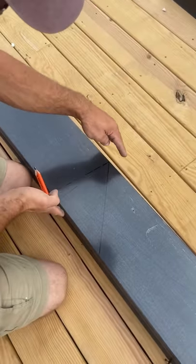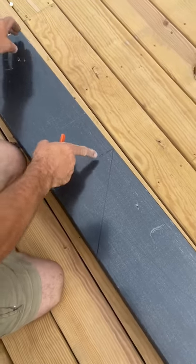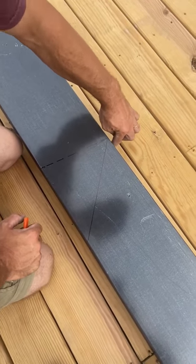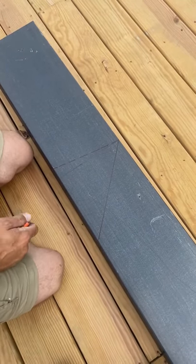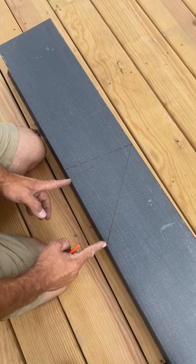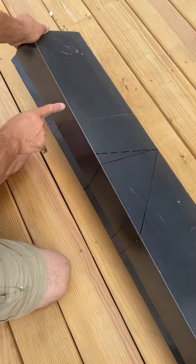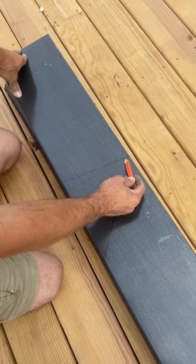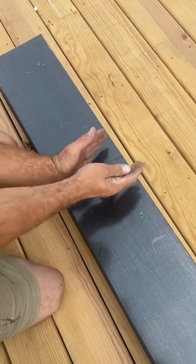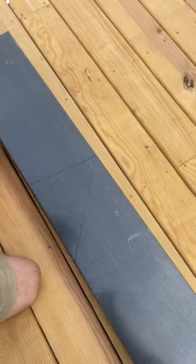The width of our coping is 8 inches. I measured it — I need a size 20 and a half to the outside bend, so that's where I'm going to have my bend outside of the corner. How am I cutting my coping? 45 degrees. So we have 8 inches of the cut, and I have to measure 8 inches on the other side — you'll see why a little later. I trim a little bit off from the 90 this way, because when I bend my coping I want to make sure I have enough room if the wall is not straight. So I have to remove all this on both sides.